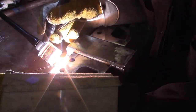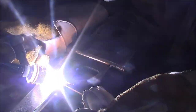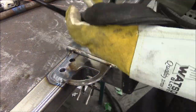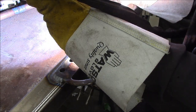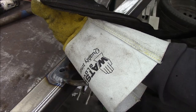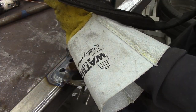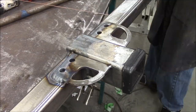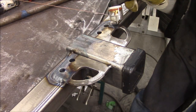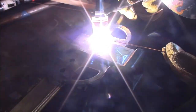This, for whatever reason, worked relatively well for me in some places, but once I got around to the other side of these chain hooks, hook bracket things, it just went funky and I couldn't master it. And I switched back to a ceramic cup and it did a whole lot better for me. Leave a comment down below if you have a clue why it didn't work well for me welding into a corner. Nevertheless, I used it. They're kind of neat.